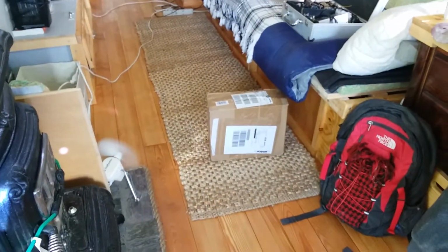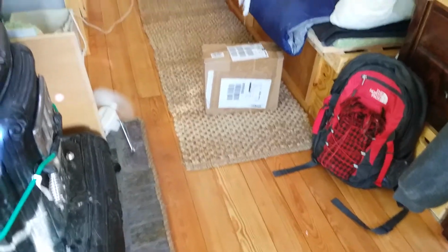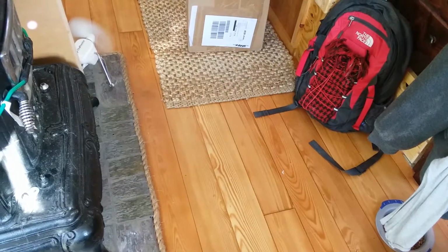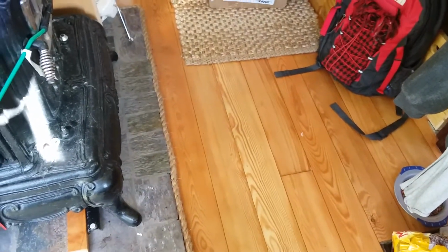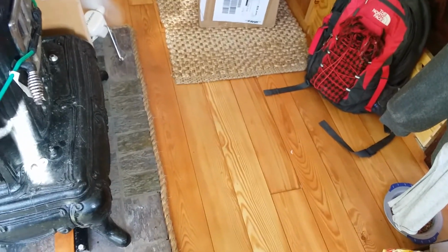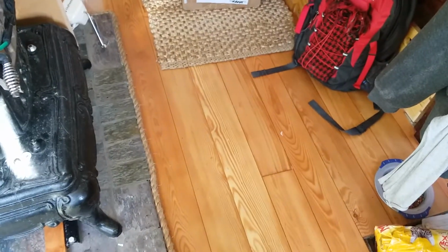So what you do is you sand the floors down, get all your old finish off, or just get the surface ready if it's unfinished wood. My last sanding on here was a 220 grit, going with the direction of the grain. And once everything feels butter smooth, you vacuum up, clean up all your dust with a dampish rag or whatever you have, and then you take a sock and soak it with whatever type of oil you're going to use, and you just start from one side and wipe all the oil in so it's sopping in there.